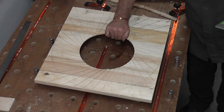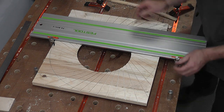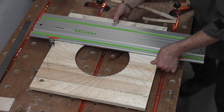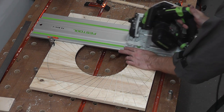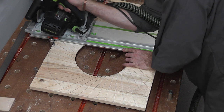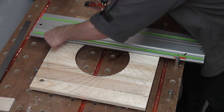Bring that round, turn it over, again get the clips on first and I've got my thumbnail position pushing against the two far dogs, so everything lines up square. I've got an idea of how much overhang we want. That's good. So let's just strip this down briefly.